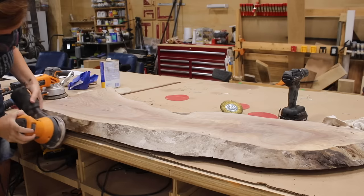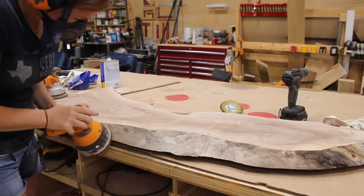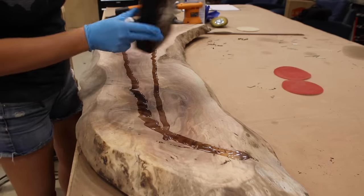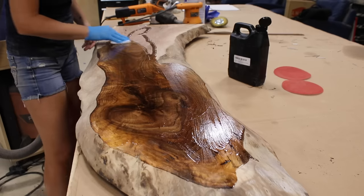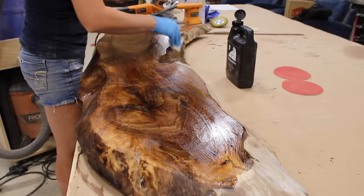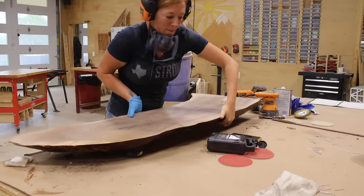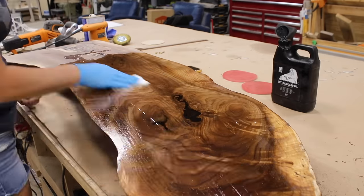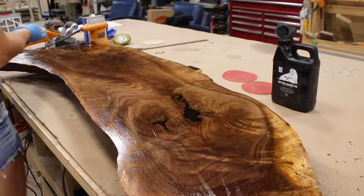When I was happy with the results I moved on, hitting the entire edge with my sander then wiping it all down to prep for applying the finish. I'm testing out a new finish called Walrus Oil on this project and found it very simple — of course it makes the walnut just absolutely pop as soon as it's spread on. I start off finishing the bottom of projects first then flip them over to do the show face. Even though these will be five separate shelves it is much easier to do all of these steps with one board as one big unit.